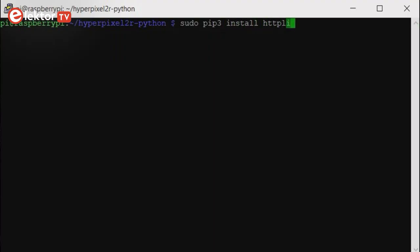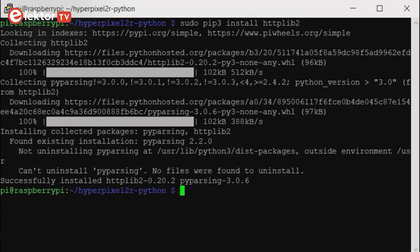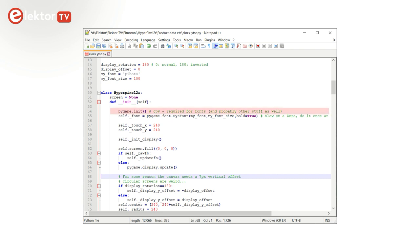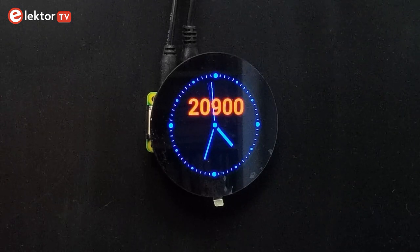First I installed httplib2, which is required for the YouTube subscriber counter snippet. Running the program now revealed that I also needed the libsdl2-ttf. Keep in mind that your application must call pygame.init if you want to work with text and fonts, and that you must load a font. Loading a font is rather long on a Raspberry Pi Zero, so I put that at the beginning of the program. Finally, I add the subscriber count on the HyperPixel display.